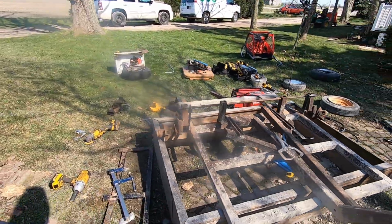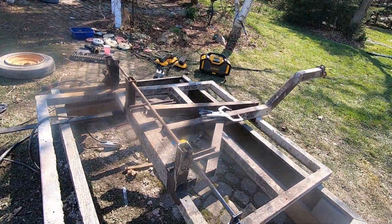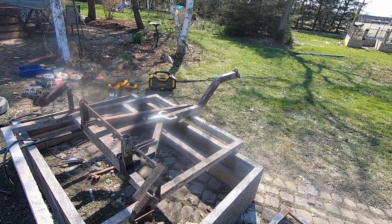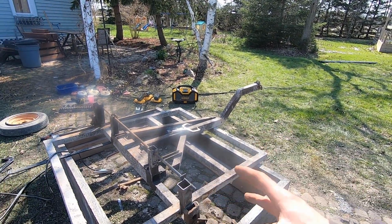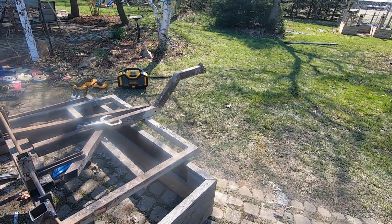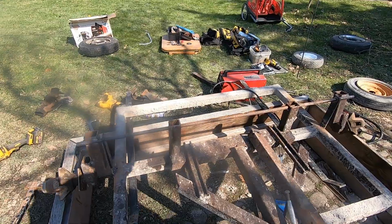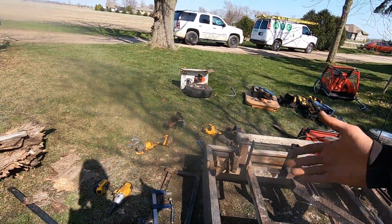We are almost at the point where we can consider doing a little bit of test fitting and whatnot. So I now have a whole rear axle that's operating on a pivot. I have to determine the resting height when it's dragging and then the engaged height once it's being towed. And that's going to be determined with where I weld the square tube to the center of the axle, in what angle is going to be considered rest.